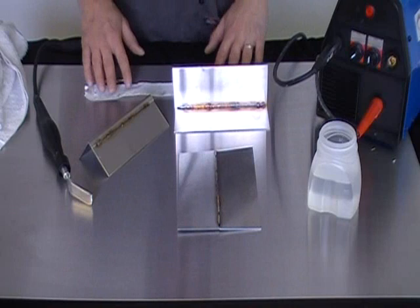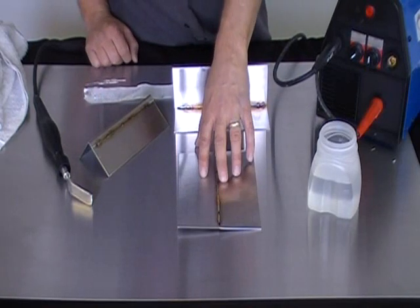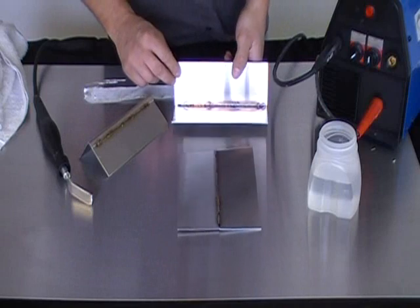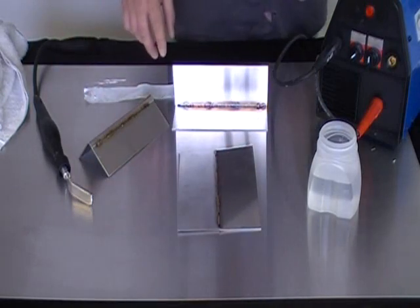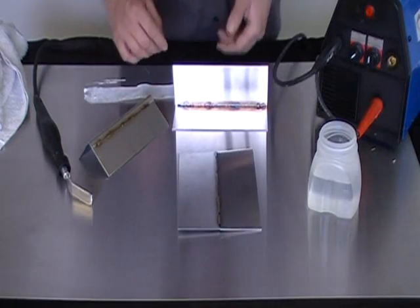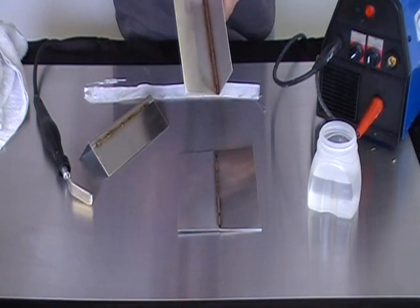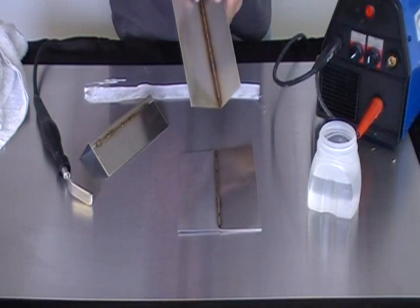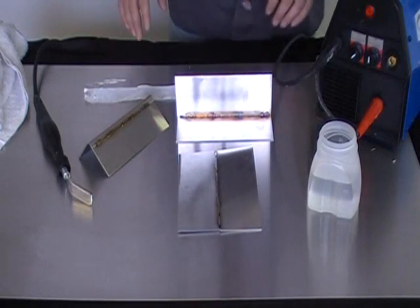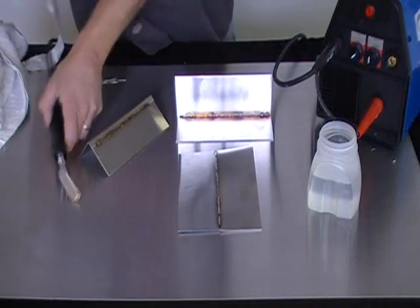When using traditional methods to polish stainless, it includes different types of hand pads and scotch-brite wire wheels, which do a good job, but they are very time consuming and the majority of times they will disrupt the grain in the stainless. Especially in inside corners where the grain might be going into the corner or in different directions, it's very difficult to clean that without disrupting the grain.